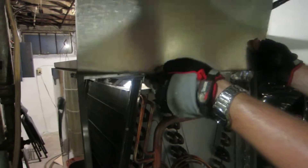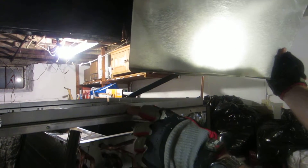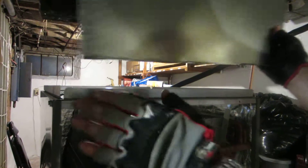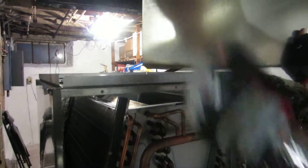What I'm going to do is I made a lip here to screw into, onto the box. I'm going to have to re-straighten this out and then screw it right into this panel, because the manufacturer gave us these extra panels to go ahead and slide this right in. They almost know that these coils and this furnace is actually going to be short for the existing ductwork.